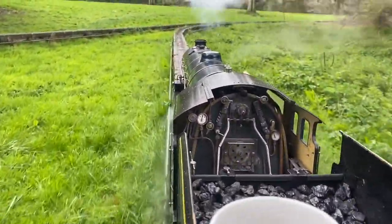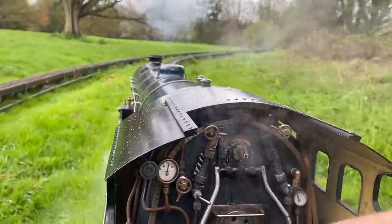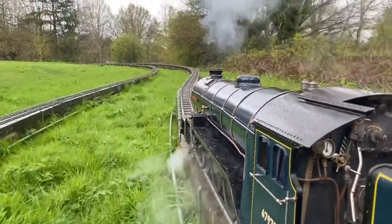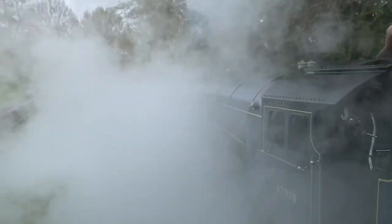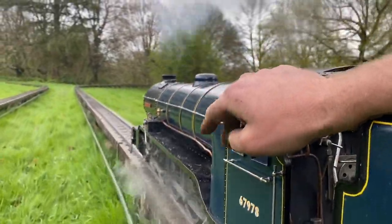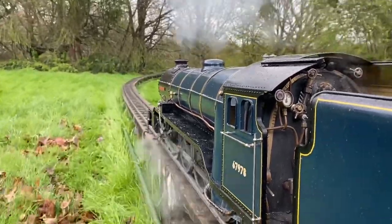She is parked — she's passed the test. There are a few bits that concern me: the regulator gland leaks a bit, that's about the only thing here. There's one leaking drain cock up at the front, and to be honest the timing doesn't sound right. Listen to that whistle though. Oh, and the lubricated drive up at the front isn't moving — it's not driving. So that's going to be something to sort out before it comes out next. Everything else I can live with.